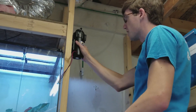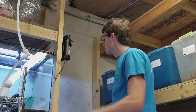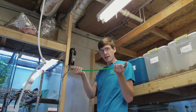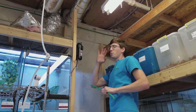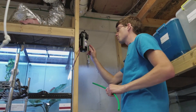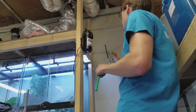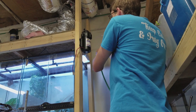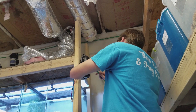Now that this is securely in place, we can start running tubing. We have our 3/8 tubing. Make sure that you're paying attention to the flow arrow. In this instance it's pointing this way, which is good — we want it to run this way. If not, you can run it upside down so that it's going in the direction that you want.